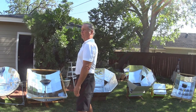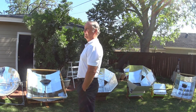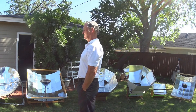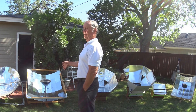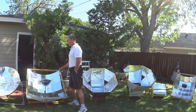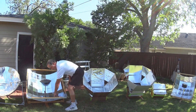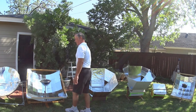One trick I've done: I wanted to make a parabolic from the plans so I just got a projector on my laptop and projected the drawing onto the big sheet, made sure it was nice and square — no warped oval — and it worked perfectly. I've got probably 30 different variations of this. The Robinson Cookers version on the web is actually simpler because it doesn't have a square frame, just side bars, but it's surprisingly rigid. The square frame worked a little better.